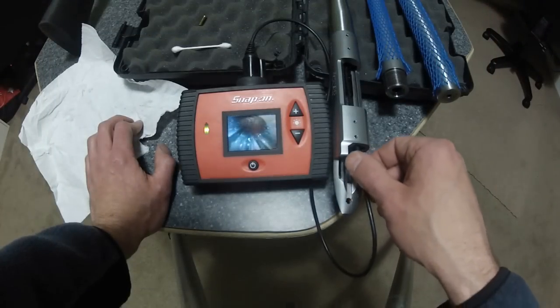It's almost a mirror polish in here. But once again, you can see all the swarf from getting it chambered — oil and swarf galore. So you definitely don't want to shoot a fresh brand new barrel. You don't want to push a bullet down this at high speed, because a soft copper jacket is just going to pick up all the stainless steel shavings and run them down your barrel.